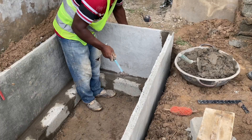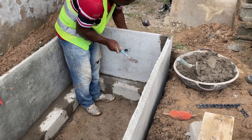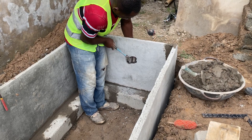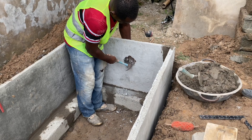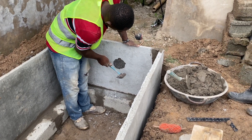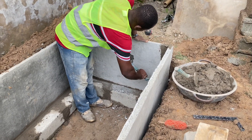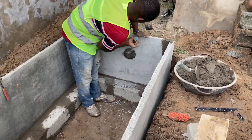This is the inlet — he is getting it open and taking out the wire mesh. Make sure you do it gently if you are using slabs; if you are using blocks, use the chisel to get that space done. The inlet pipe is going to go into this particular hole. The level we are achieving is because the pipes are coming from the back and some are coming from the right side of the digester as well.